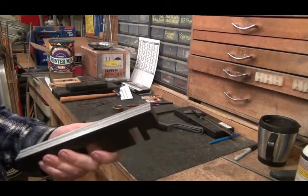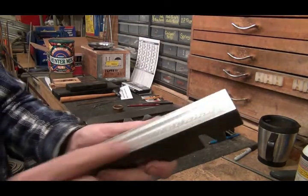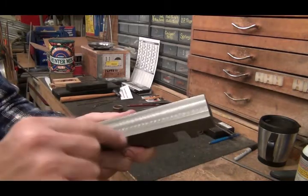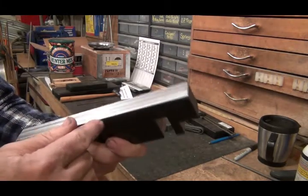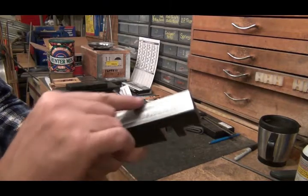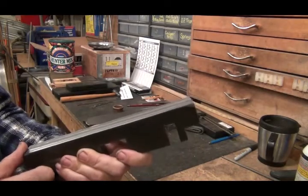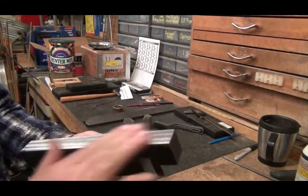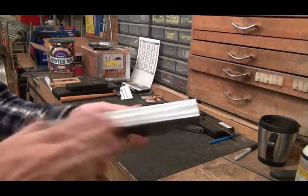I'll have to work on it some more. You can see the lines from the mill and you can see the circles as the mill was cutting. If it was exactly right you'd be able to see the whole circle — you'd see it cutting on this side and this side as it was traveling lengthways, at least that's what I think. But it's pretty close. After I did the bottom side I flipped it over and did the top side.